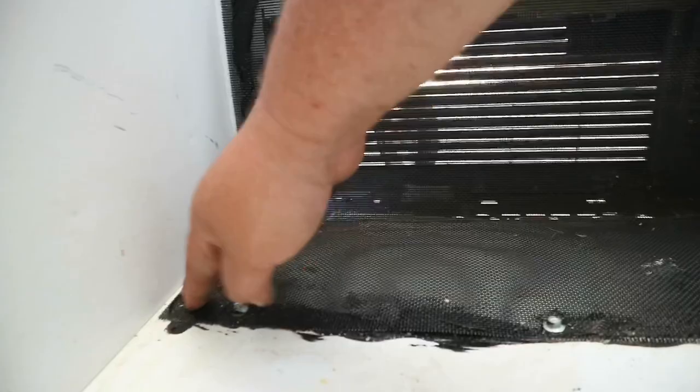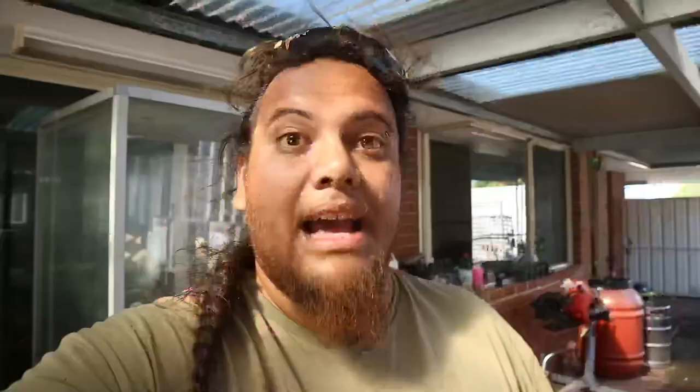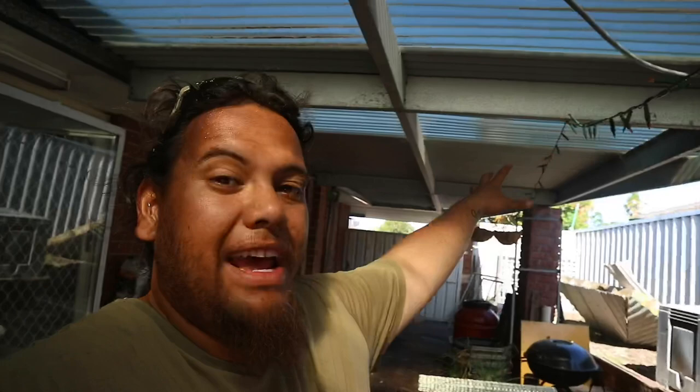That's where the vent is at the bottom. If I need to in the long run, there's a whole little square or rectangle space where the motor was and it's completely empty now. So I can put maybe two computer fans in there and that'll circulate the air so it doesn't all sit in there. In enclosures you want an in and an out — a bottom vent at the bottom where air comes in and a top vent at the top that takes the hot air out. That's why you see vents in enclosures at the bottom on one side and at the top on the other side, so it creates its own sort of suction.